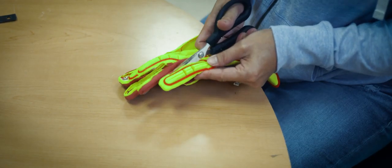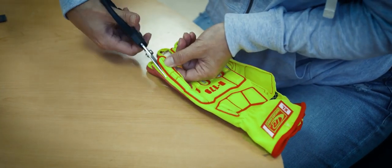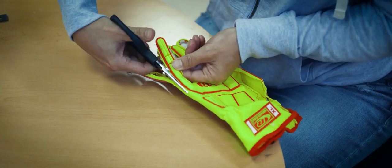That gives a good average of the overall finger protection and doesn't allow one area or the other to be what gets rated. Then we cut the glove in half so the upper portion of the glove will go on the impact anvil. This way we're only getting the force that transmits through the bumper, through the glove, into the hand.